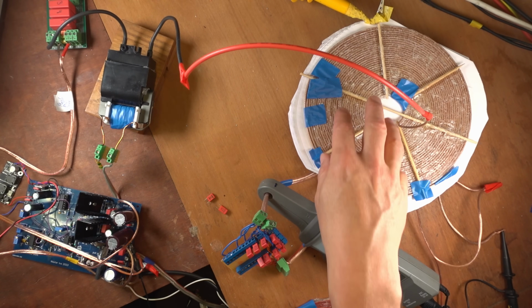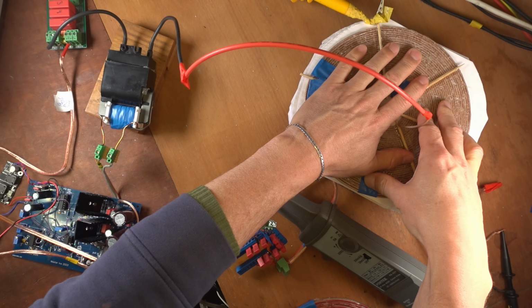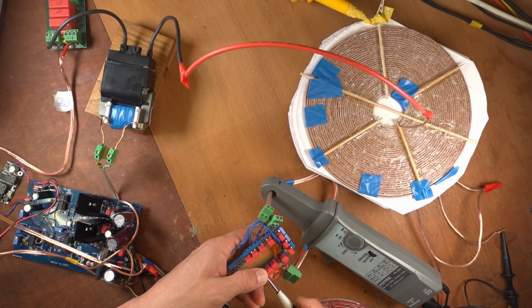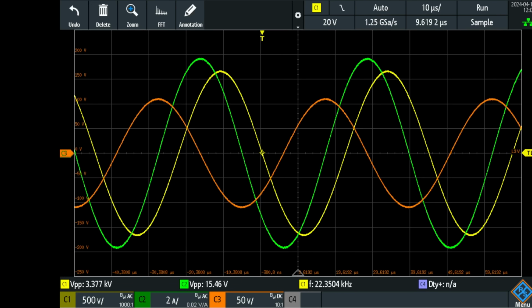Okay, I put the paper back between the plates so it's at 15 millimeters distance again. We'll add that 100 nanofarad that fine tunes it to the correct frequency. And now we should be able to get that high voltage and high current peak at the same moment in time, at around 22.3 kilocycles per second. Let me turn on the system again.